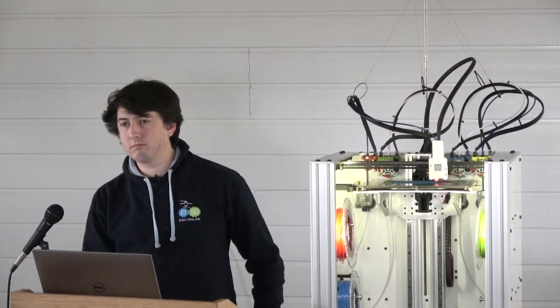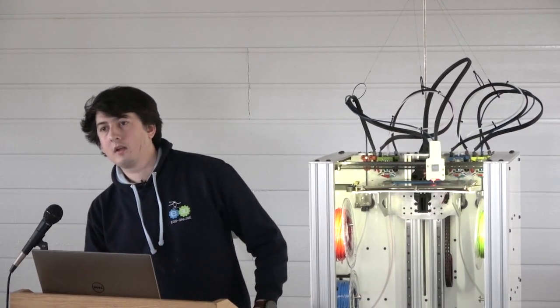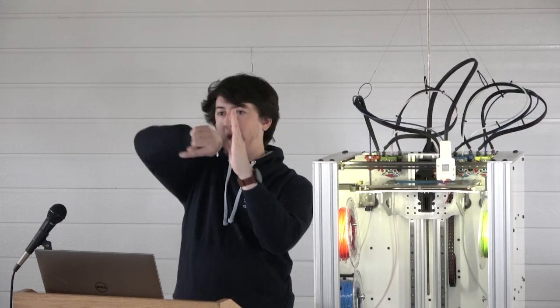You what, fam? What? Say again? Are you talking about how the NEMA 23 has the separate faceplate so you put the screw in from farther out? Yeah. So you have a plate and you have a NEMA 17 and you want to mount it like such. And so we're doing it with standoffs and screwing in like that into the front of the NEMA 17 faceplate. For NEMA 23s, there is available, pardon?